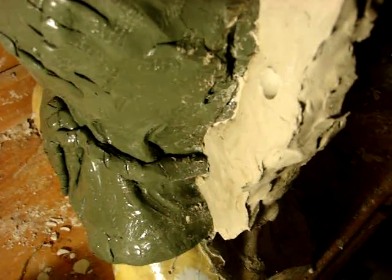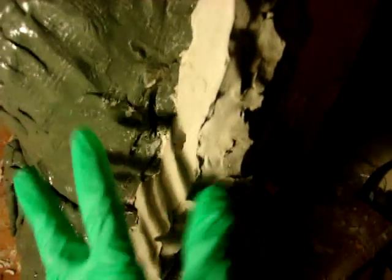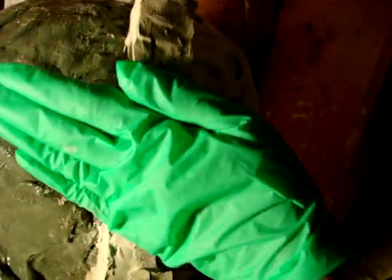And also, when you guys are done applying the Vaseline, what you need to do is get your water-based clay again. You're gonna lay this flat, and you're gonna make another containing wall, but not a dividing wall. So you're gonna make another set of containing walls that will go this way. See that? So you can contain the plaster for the second part of the mold. Now you're gonna build it right here, all the way around.